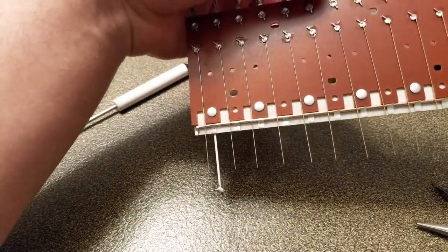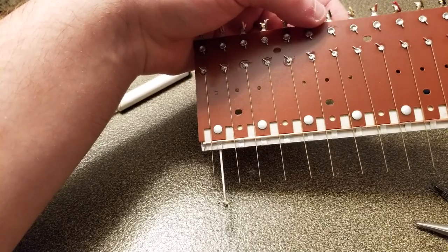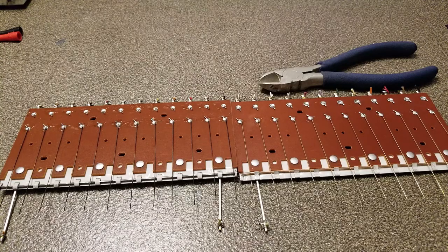And there you have a silver rail key switch, except with gold on copper. One last thing I will mention is that if you have the opportunity to use the silver rail contacts — if you have any of them in the instrument, and chances are at least the pedal board will use them — definitely use them as it will reduce the amount of work you have to do. Retrofitting this organ is a big job, and you don't want to cut corners, but if there's a logical way to reduce the amount of work, definitely take it.